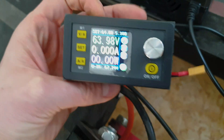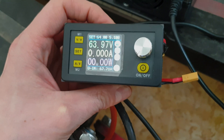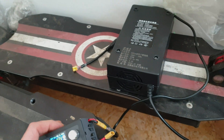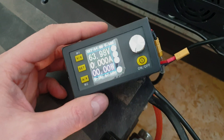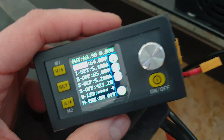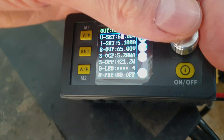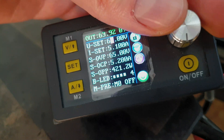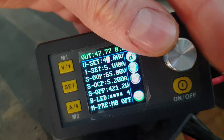You can set what voltage you like — in my case I'm using an XT30 connector, but you can use any kind of connector you like. Thanks to this setup you can charge not only the Yanobike T85 but also something like the Langfait L8 or Xiaomi M365, because you can set whatever voltage you like. As you can see, just click and now we've got 64 volts, and you can decrease this down to 50, 40, and so on.